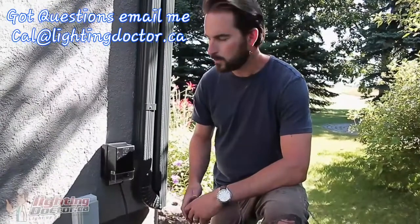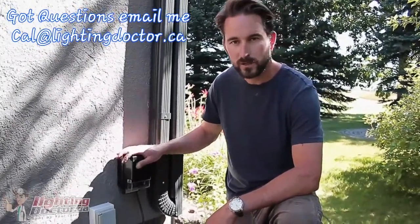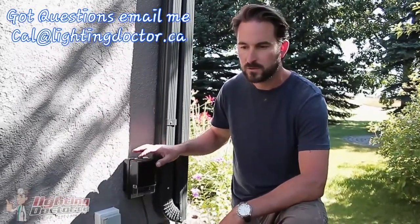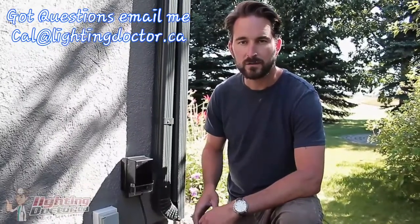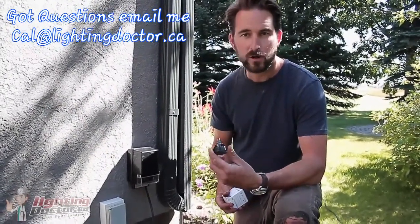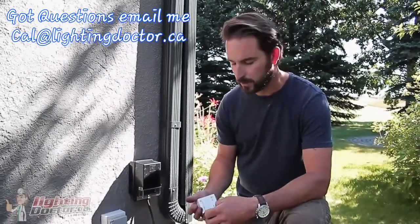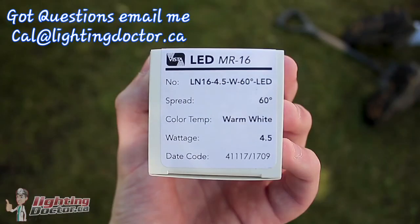Just want to explain a little bit about the transformers, so basically the brains of your system. After you've placed your lights and you know what kind of lights you're going to use, the next step is determining what size transformer you're going to use. A real simple way to do this, if you're using a good quality light, is that when you buy it, it'll usually tell you how many watts that fixture is going to produce. If not, if you look on the bulb, it'll tell you if it's 4.5 watts or 5.5 watts. Typically for LED, that's about as big as you're going to get, but on the box it should say how many watts if you're buying a good quality fixture.